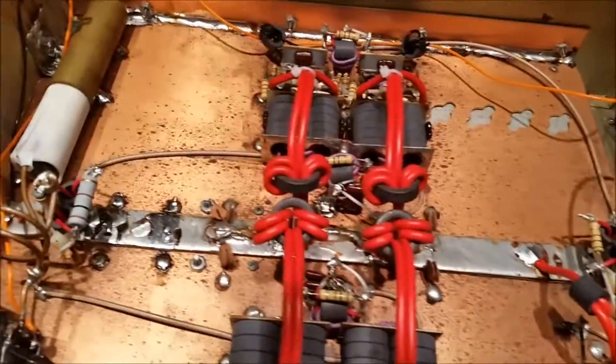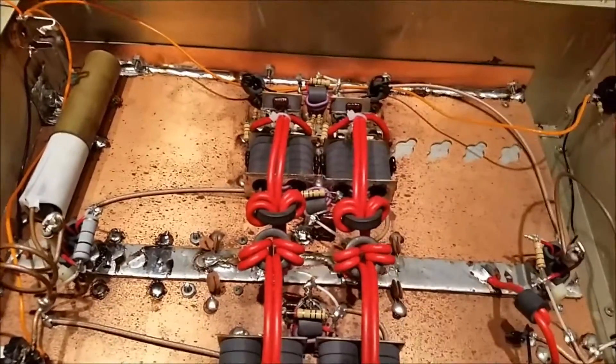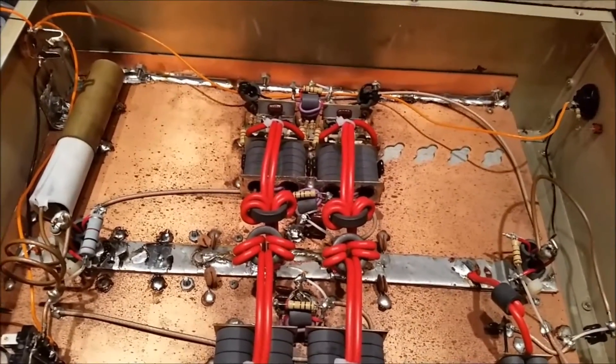The power wire that comes off the strip down the center, coming out the back of the box, was going right underneath the caps. So when the caps swelled up, they pressed up on the center of the board. Being in a high humid environment, the board continued to buckle. I'm going to cut away and show you a quick picture.